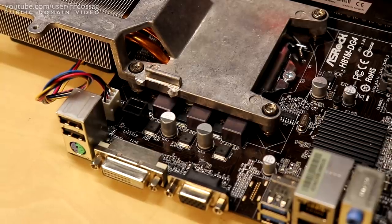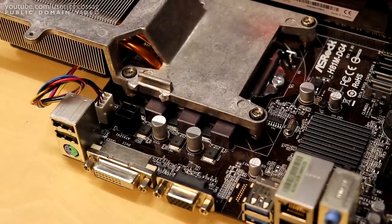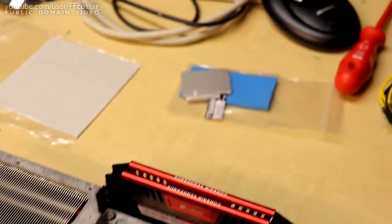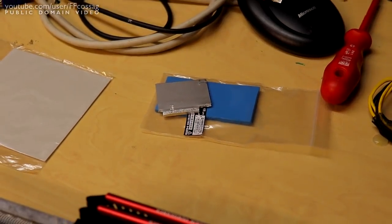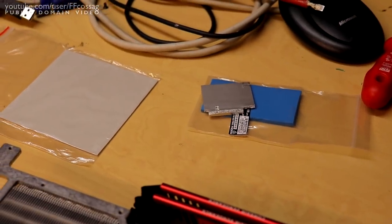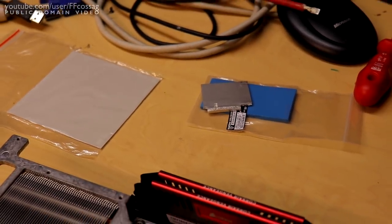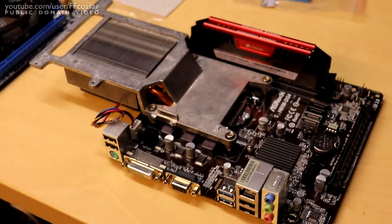The VRM portion of the board gets up to about 100°C under full load, and that's not okay. When we install the board, we're also going to be installing some thermal pad and a piece of aluminium, thermally coupling the VRM to the case of the whole device to provide it with some cooling. As long as it stays at 80°C and below, I'm fine — and I think that's going to do it, because with no airflow you just have no cooling on this board whatsoever.